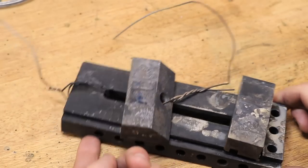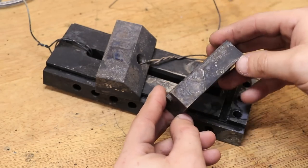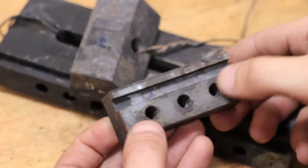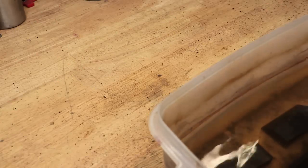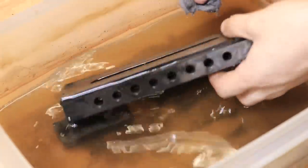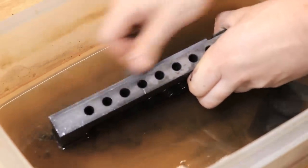These are the parts after quenching. I also tempered them in an oven off camera — I did them for a few hours at about 160 to 170 degrees Celsius, which is a fairly low temperature for a steel temper. Doing it at such a low temperature will help retain the hardness. I'm also sure that you'll have noticed that there is a fair amount of oxide scale which has built up on the part. There are many ways of removing it, but since it was the end of the day I decided to give it a soak in vinegar for a day or two. As it turns out the vinegar soak was pretty unimpressive — even after two days it took a pretty hefty scrub with some steel wool to get most of the scale off. Of course there are ways to prevent the build up of this oxide; for instance I could have used a flux, but doing it on these parts would have required a fair amount of flux.